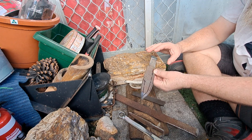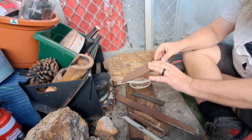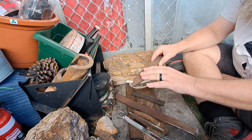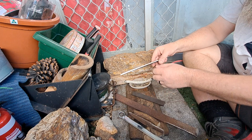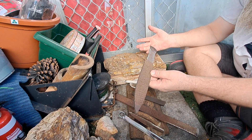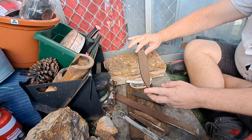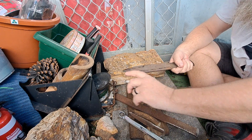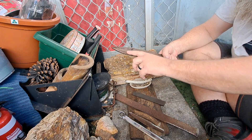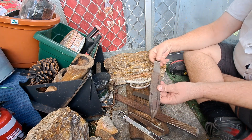I will now grind the bevels in — get the bevels all ground up. Basically take this rasp, because this is a rasp, it's about 5mm thick, then grind the bevels out, take this aggressive rasp part off, put it in the forge, get it up to temp, quench it in oil, temper it, and then she's all done. This is going to be a sticking knife — about an 8-inch blade, paracord wrap on the handle, a bevel here and a swage there, basically a false edge — quite an aggressive bevel — just a big sticking knife.